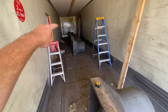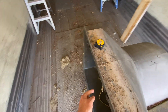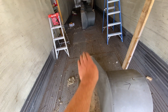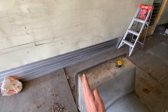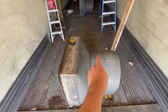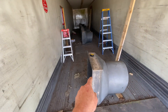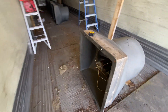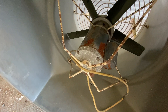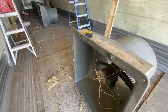These are the fans — going to space them evenly, six of them in here. Really nice large plastic housing. We'll have mounting on the front face as well as to the two-by-six. We did test them all and confirmed air direction — I've definitely hung fans before going the wrong way, so learned my lesson. These are well used out of a meat bird barn, a very harsh environment — ammonia, very acidic from the chicken waste.